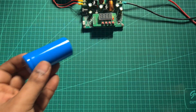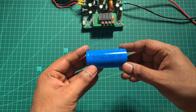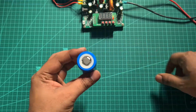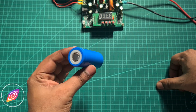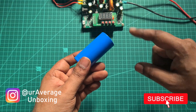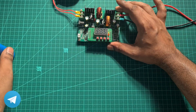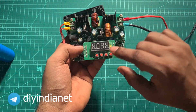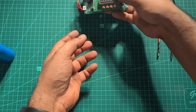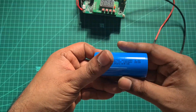Welcome back to my channel. Today I have another quick video for you — this time it's going to be a lithium iron phosphate 32700 cylindrical cell test. These are FB Tech 6000mAh cells, brand new. The test we are going to do today is a puncture test of a lithium iron phosphate cell. Before we do that, I'm going to use a buck boost converter to fully charge the battery to 3.65V, so we know what happens when you puncture a fully charged battery.